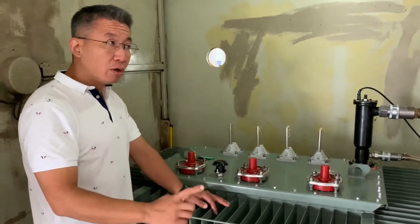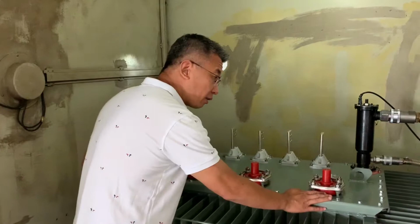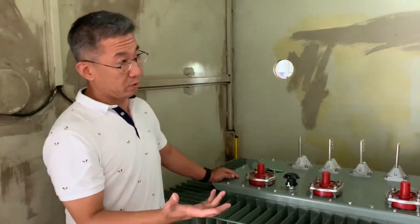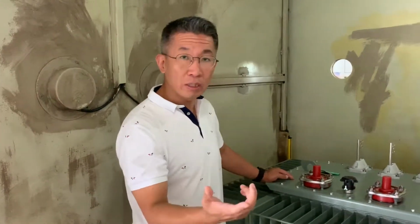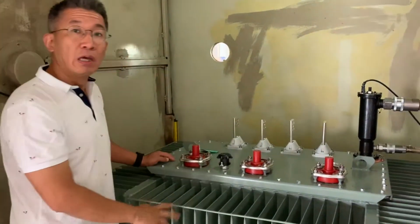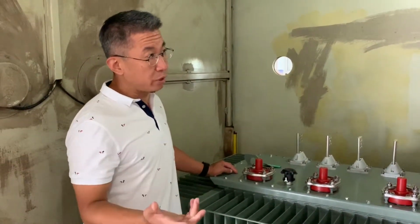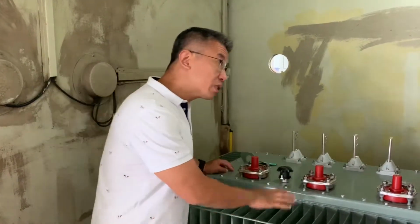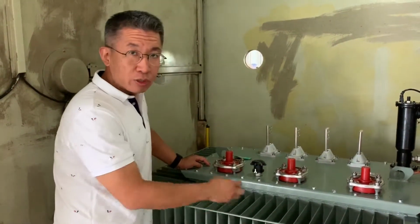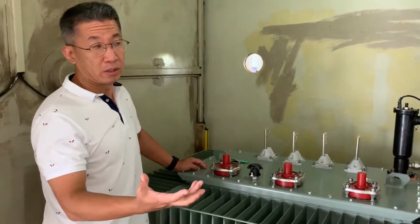And after, we must close the oil tank hermetically. Then during the whole life of the transformers, there is no contact between the atmosphere and the oil. And we made the test in the laboratory. It shows that with this special technology, the insulation papers can last 30 years of service life.